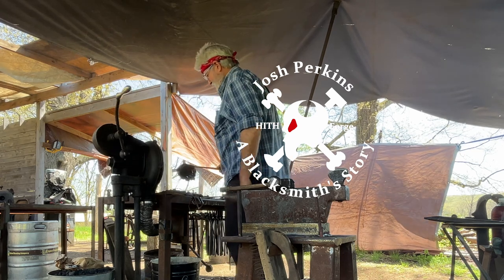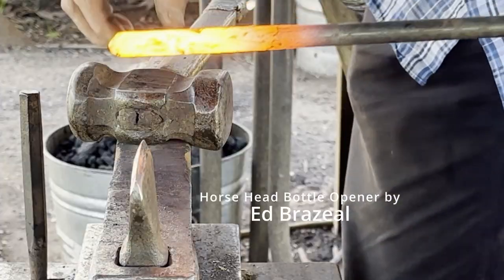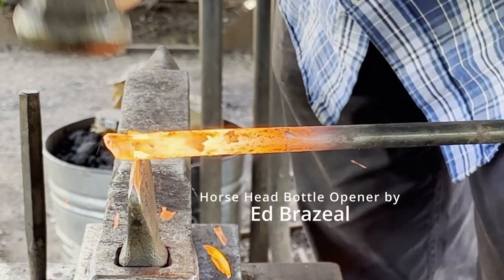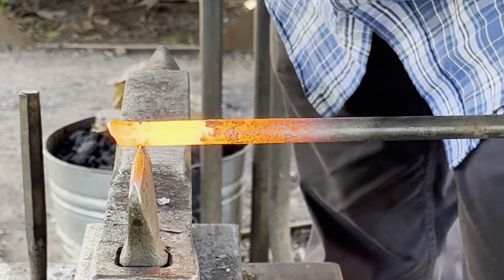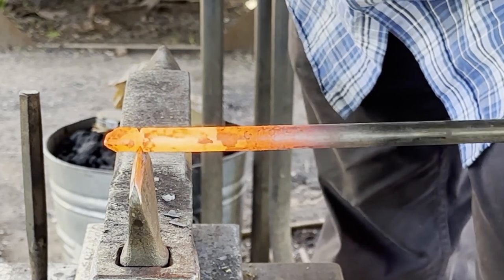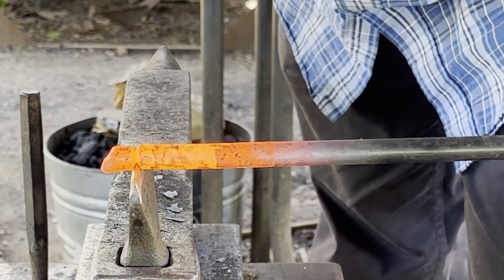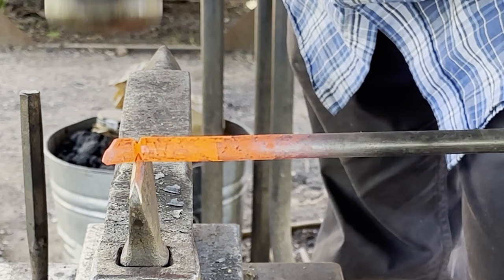Okay, I'll do a cut to center. It's got a flat on the end and a tip, or just a tip, but I'll rotate towards me so I see the cut line come up over the horizon, and I can keep a straight cut turning it to me easily, because you can see it as it rises up over, and it cuts to center.